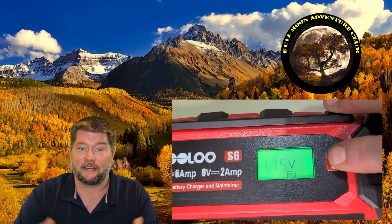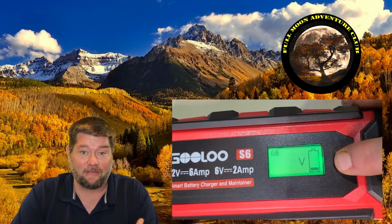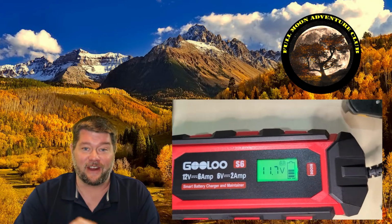So it has 0 voltage. Now, some battery chargers, when you connect them, they won't read any voltage because there isn't any. It's in shutdown mode. And so it won't start charging the battery because it doesn't recognize that it's been connected to one. So what I did is switch this to the 12-volt power supply just for a second. That woke up the battery, and then I switched it over to lithium iron phosphate mode to charge that battery. Be careful you don't leave it on constant power mode because it will overcharge the battery and that would be bad. But it's a very, very cool feature.